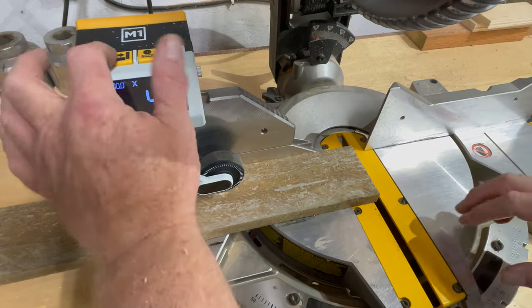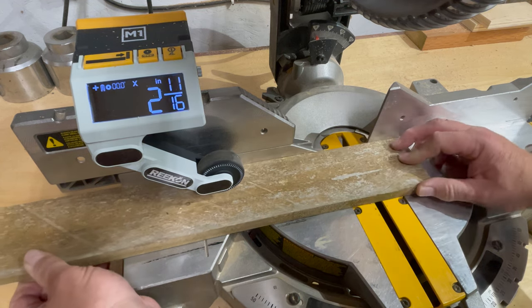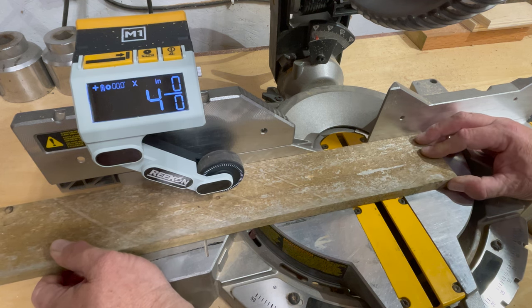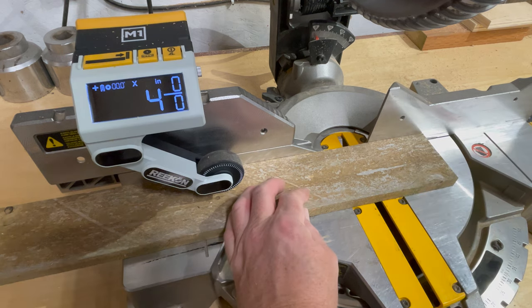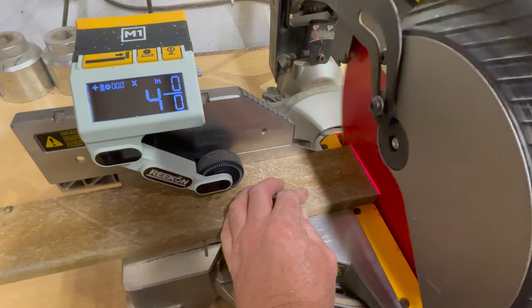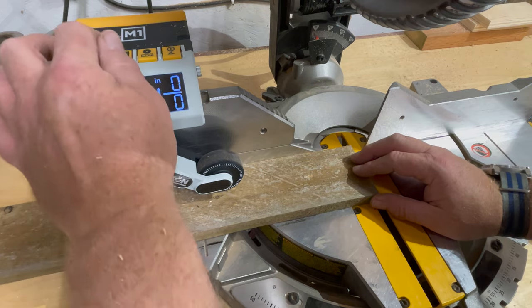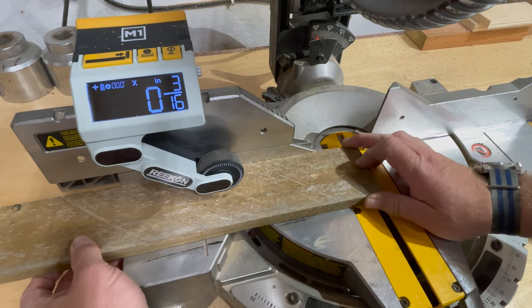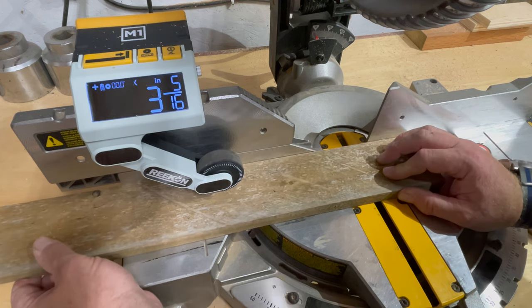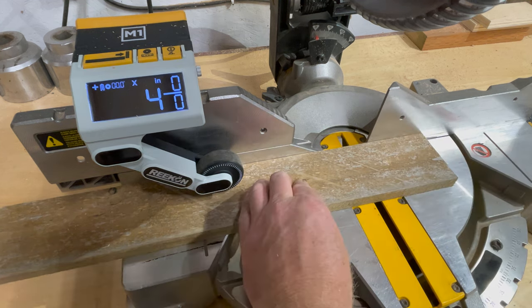That to the side, zero that out. Bring this through again, roll it through. Now I'm pushing it kind of slow because I'm a newbie. Wow. There it is right there. So you could probably push it faster, but let's check it out. Two cuts. Zero, because we already cut and touched off on this side. Slide it through. Man, is it sensitive. But that wheel is really gripping that nice. There it is, 4 inches. One last.